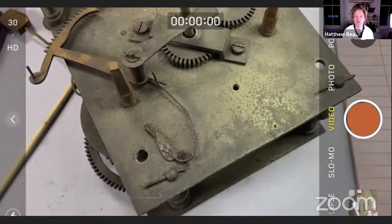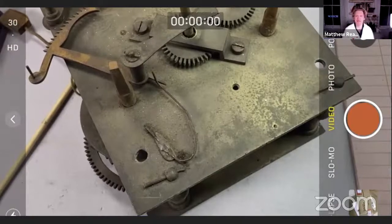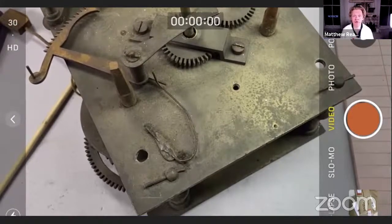Yeah, rack spring brass. Yeah, probably one piece filed from solid, or probably from a casting. Nowadays, it seems so difficult to get these small castings done. But on the underdial work of 18th century English quarter striking clocks, you get those nice little cast, one-piece springs, and that's probably what it would have been here. So yes, it would have been brass. You do obviously get steel springs in continental work, and I'm sure in English work as well, but I'm pretty sure this would have been brass.